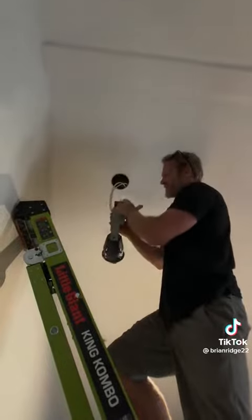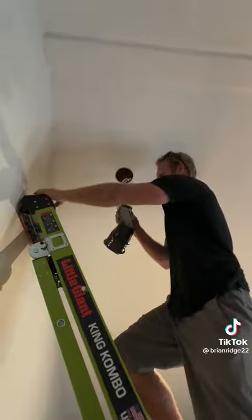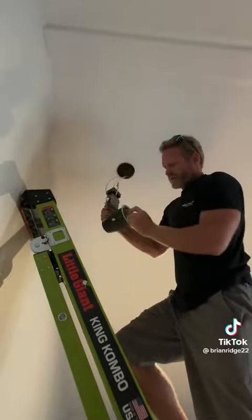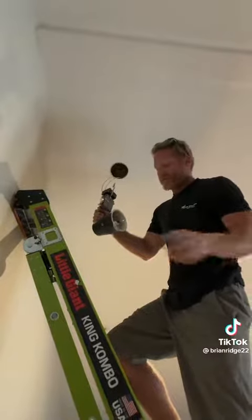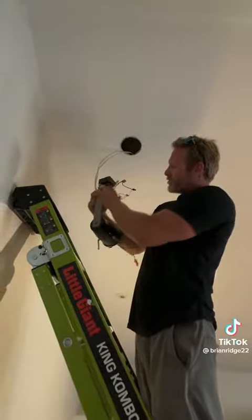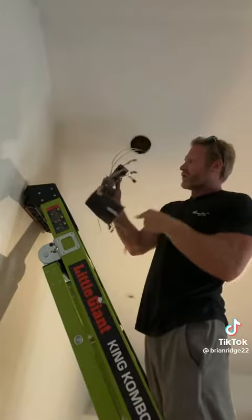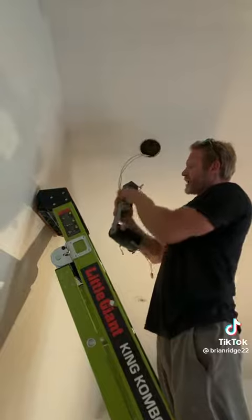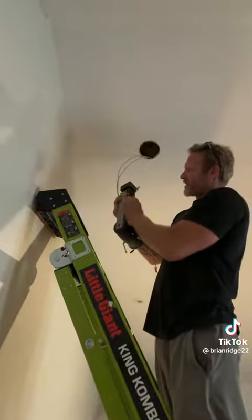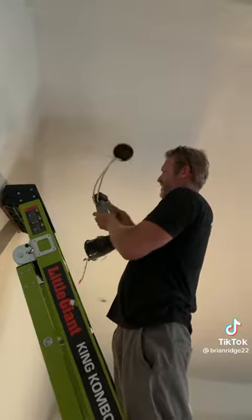And now I'm going to disconnect this transformer and send direct power directly to the socket. And then I'll install the adapter on the new trim. So now that I have my neutral and my power wired directly to the socket with my adapter installed, I can put the cover back on the J-box and then I can put the can back up in the ceiling and install the retrofit kit.